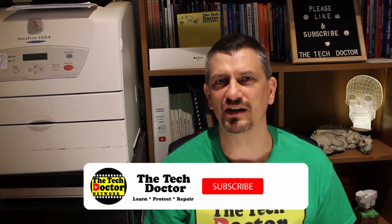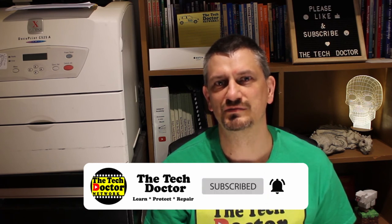Of course, we don't always have a DSLR or a webcam and computer handy. But we've almost always got our phones in our pockets. One trick I learned is that iPhones, since about the iPhone 5, actually have an infrared filter on the main camera. There's some reason around taking really good photos that makes this useful, but what it doesn't make it useful for is testing infrared remotes. For that, you have to switch to the front-facing camera and test whether the remote is working.